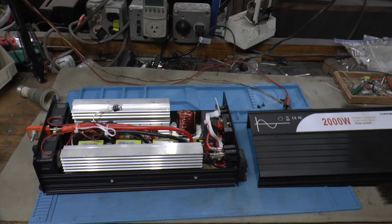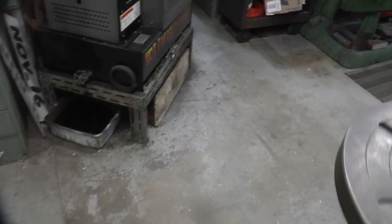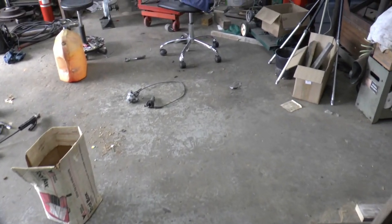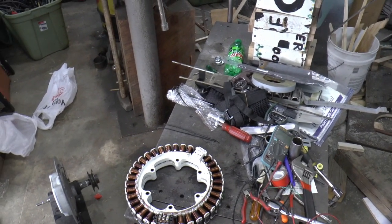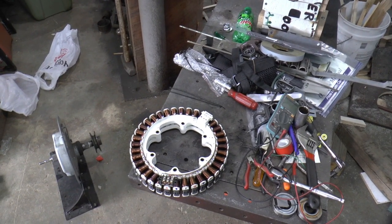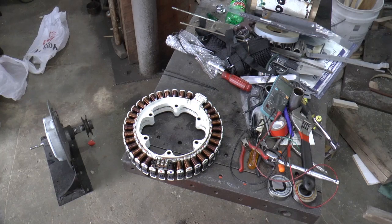So the old inverter that ran for 15 years before is back in again. I decided the water was low and switched over to the other aluminum-winding washing machine motor slash generator. When the batteries were all the way up and it switched over, it would switch and then go back — the relay just kept clicking. It made enough voltage to set it off, but then when it came back on it would slow down and drop out. So I decided I would cut it in half so it didn't make quite as high a voltage.